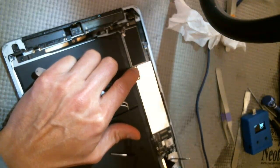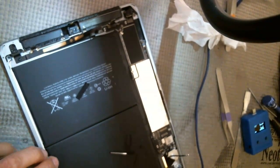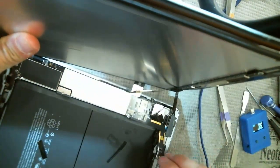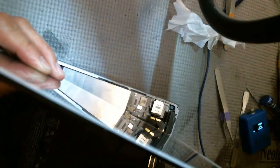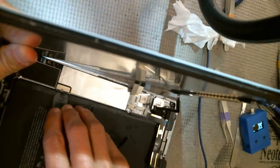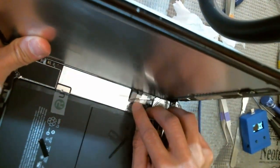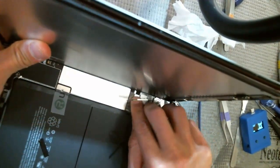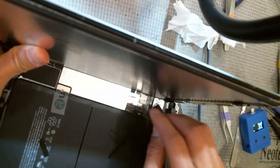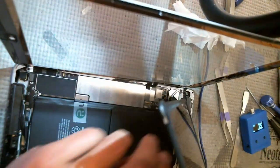I guess the other question is, before I do anything to it, let me just plug the screen back in, and let's make sure this thing turns on. Because the other common problem is the thing only charges when the iPad is dead. So I just want to make sure that is not also the issue, because I think it's highly doubtful. Usually, when there is an issue like a charge port repair that's definitive, then that is most likely the only issue.